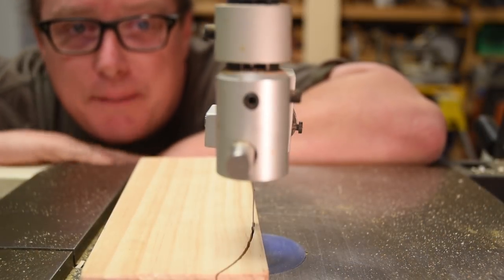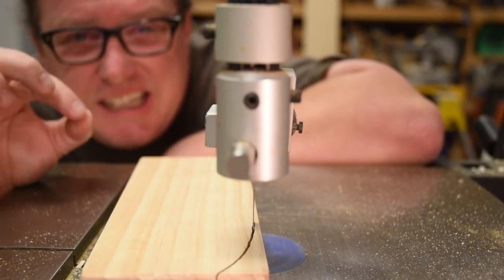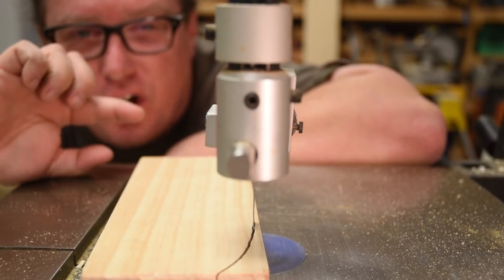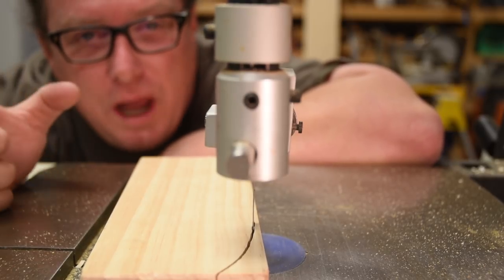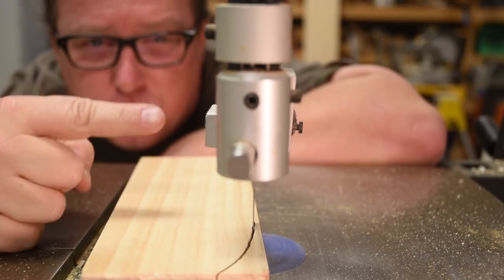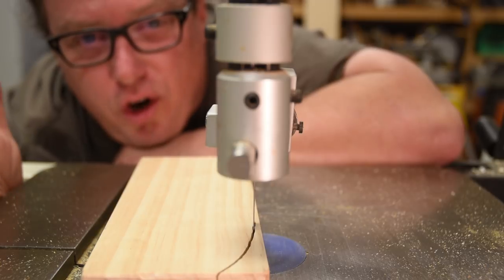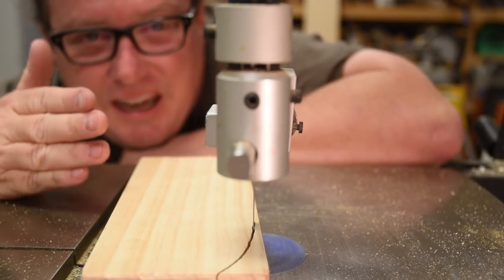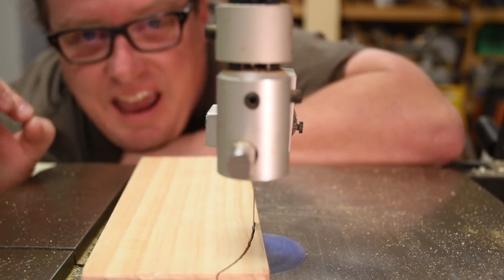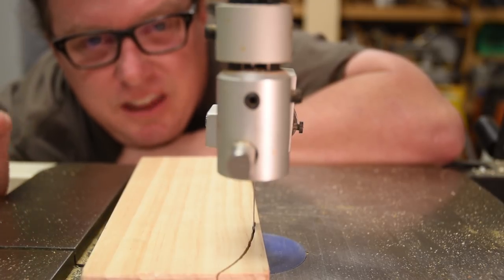Could you tell when I made the curve just right? Because it was just kissing the back of the blade. And then when I tried to turn it a little bit tighter, the blade started to twist even within the guides. So if you're needing to make tighter curves than your bandsaw blade can handle, you're going to have to make relief cuts so that you're not pivoting off the back of that blade.